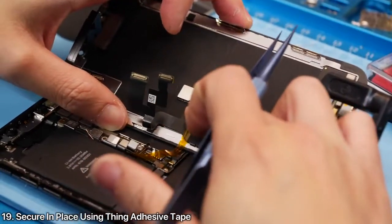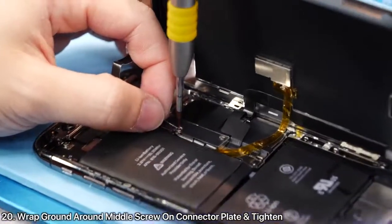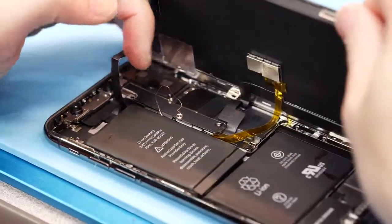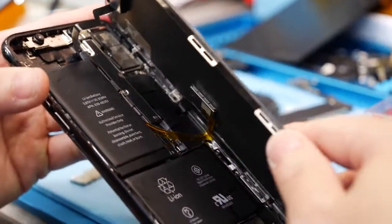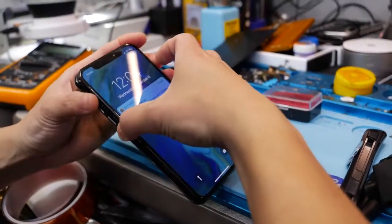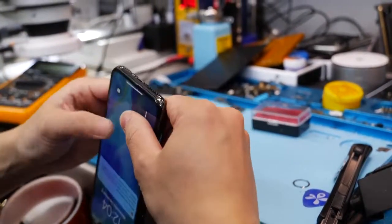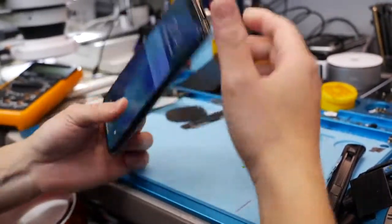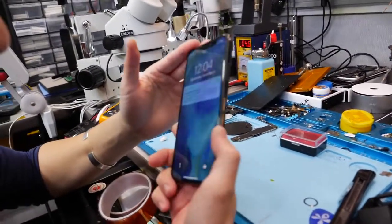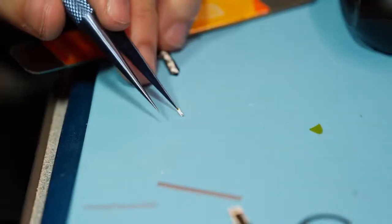If you're doing this to an iPhone 7 or below, he's going to do a very good job. I honestly don't know if I'd recommend this to an iPhone 8 unless you really have nerves of steel and are willing to see your iPhone go through this. He will actually make you sign a disclaimer if you're giving him a 10, 8, or 8 Plus — it's not his fault if certain things happen. For the ground cable, it doesn't matter where you put it as long as it's grounded — I recommend putting it at the plate connector screws when closing the device. Before closing the display, make sure it's working — test it out. In this case it looks very good, very even, and that one is done.